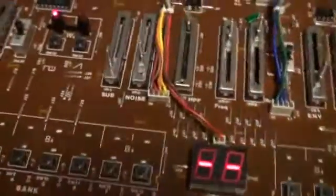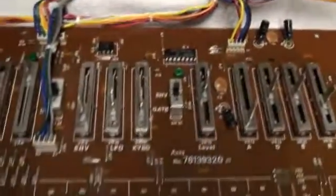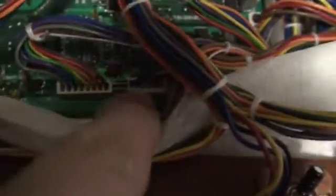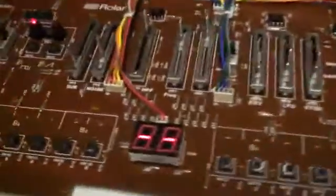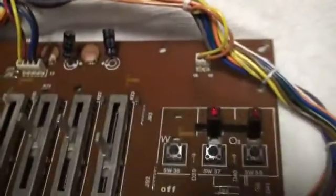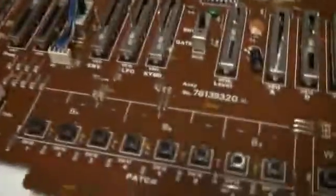When I first connected this, I had a couple of problems. I foolishly connected this jack to this location down here, because they're exactly the same. See that jack and that jack? They're the same, and they even have the same color wires — so don't rely on wire coloring, which is a technique I normally use. Be careful. You can get those two juxtaposed. And then there's the one that goes to the power and another one over here, and I got those jumbled as well. It's thankful that in my confusion I didn't blow something up.